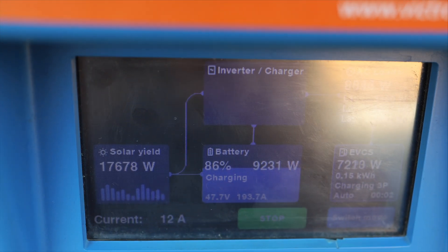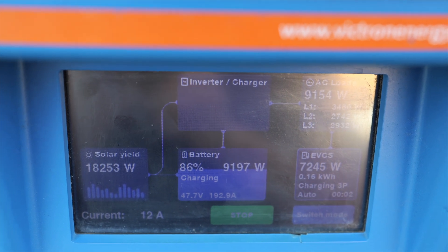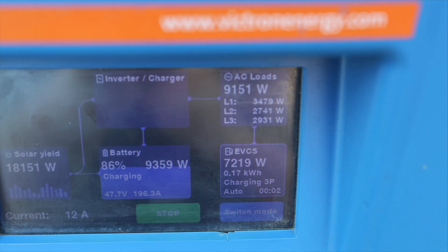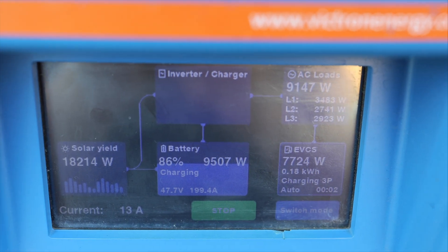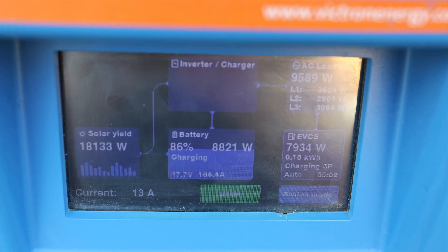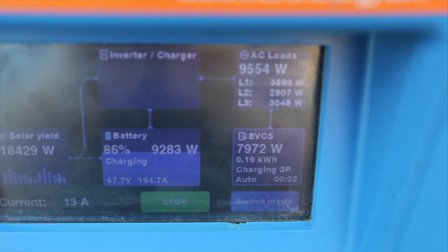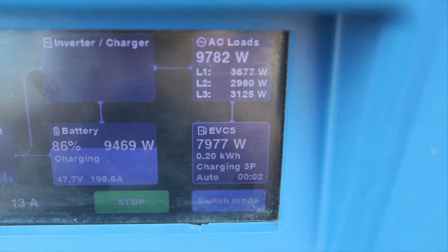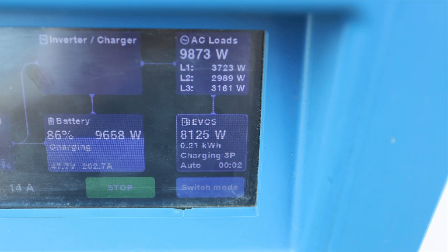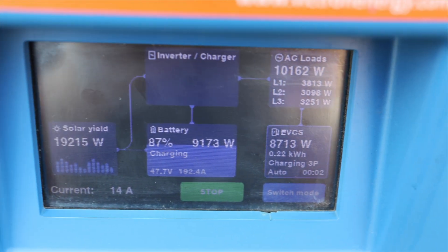We have 17 kilowatts. The home battery is charging with 9 kilowatts. I set a rule because I want to decrease my home battery power and move the entire battery capacity to my car battery once the home battery rises above 80% — and I'm at 86% now. So my home battery will decrease soon, and the car battery will receive more energy. Almost 8 kilowatts.